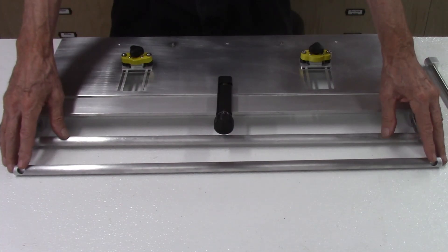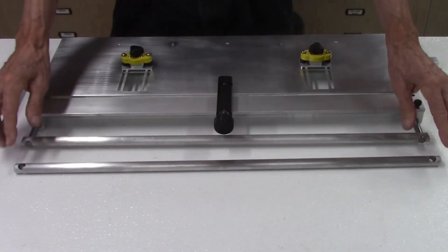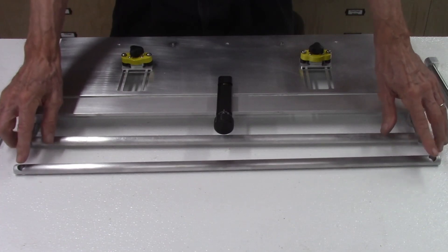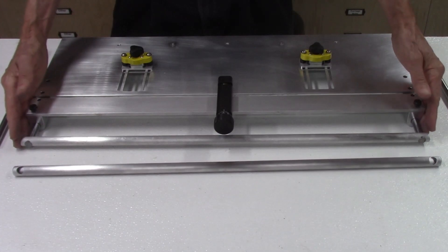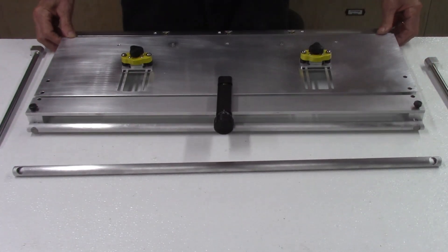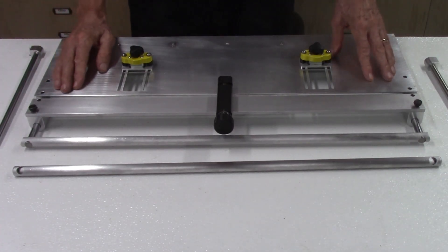The dimensions of the spacing of these two holes is quite critical. The two holes are 0.473 inches, that's minus zero to plus 0.002 inches, and the space between the holes is exactly 25.5 inches, plus or minus 0.002 inches. In addition, these two holes must be perfectly straight and parallel to one another, because this bar needs to maintain the spacing between the two guide bars on the AccuSlice system. If the dimensions are off or not parallel, the index table will bind on the guide bars and will not slide freely.